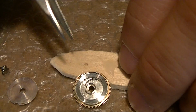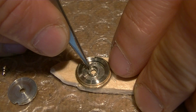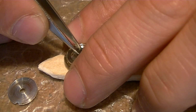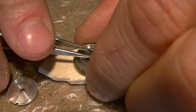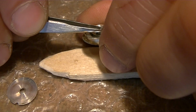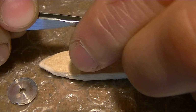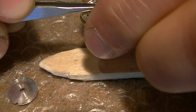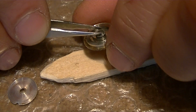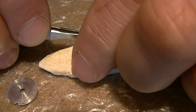But what I believe it is that the mainspring, this bend here, is too tight, so it grasps only on the tip of the barrel and thus slips away. And to prove my point, I will reinsert the arbor on the tip of the arbor, not the tip of the barrel. I'm replacing the arbor in place and turning it with the tweezers so that, at least I'm trying to, it catches the mainspring.